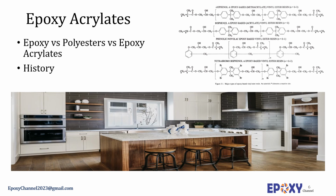These resins were identified as epoxy methacrylated or acrylated and were shown to provide chemical resistance superior to that of premium chemical resistant polyester resins of that period. In 1966, Dow Chemical Company introduced the Derakane vinyl ester resin designation, with the introduction of similar resins for molding applications. In 1977, Interplastic Corporation, and Reichhold Chemical Company, introduced vinyl ester resins under the Corezyn and Corolite product designations, respectively. Since then, numerous products have been introduced to the market.